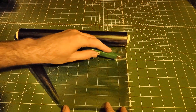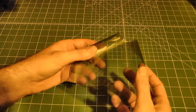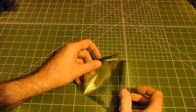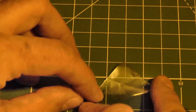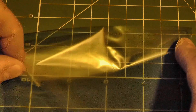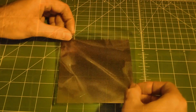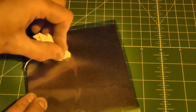It's made of three layers. The photosensitive layer is sandwiched between two removable coatings. It comes off the roll with a natural curve, and at this stage I'd like to uncover the surface on the inside of the curve. A piece of tape on one corner lifts up the protective coating so that it can be peeled off. It was then gently pressed onto the bare metal surface, and all of the air bubbles were removed.